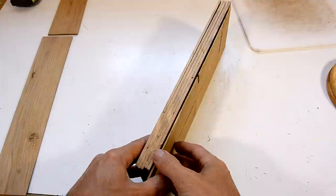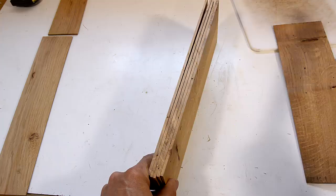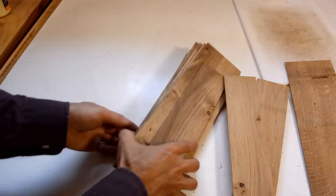I ended up passing my workpiece over the jointer between making cuts, just to get a smooth surface every time. As a result, my sixth layer became unusably thin. So I used this scrap and ripped a few more layers off of that. I will use two of these pieces and one of these.